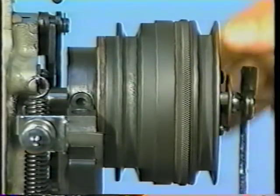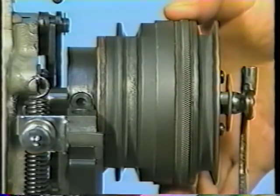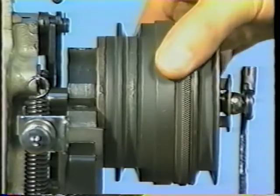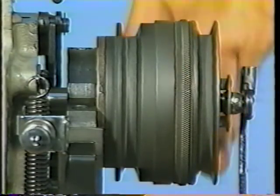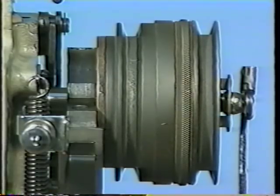When the sewing machine enters the stop motion state, the changeover pulley that has been in contact with the low speed pulley moves away from the last stitch. The changeover pulley and the low speed pulley are then released, and they rotate about once by inertia before the sewing machine enters the stop motion.